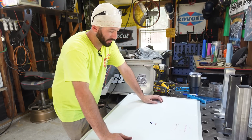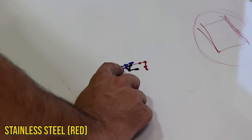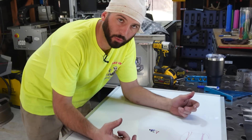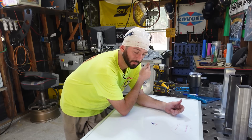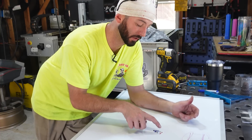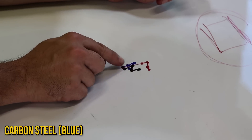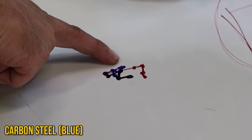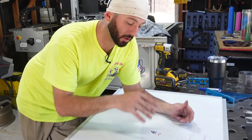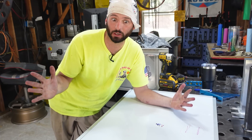I've never tried this experiment before and I think it's a bit of an eye-opener. Looking at the stainless results: the first weld grew significantly and went all the way up to that point, then every weld after seemed clustered near where you wanted it. The first weld is the most critical — you need to make sure it's the most secure, or fit the part knowing it's going to move. Moving into carbon steel, everything stayed pretty close to where it needed to be. Carbon steel without being clamped is going to give you the best result for keeping things square.